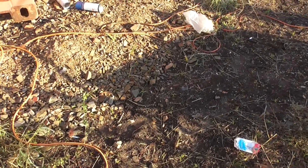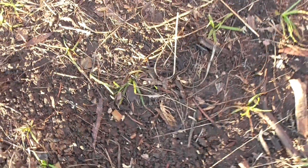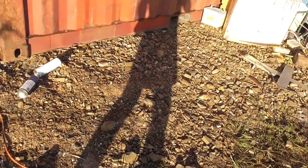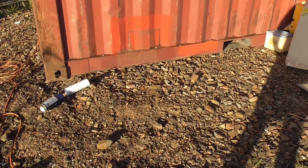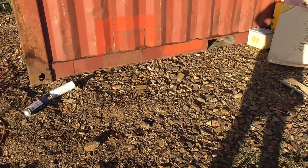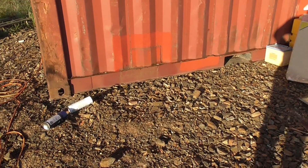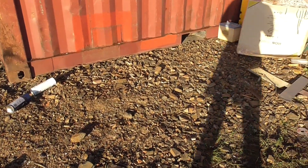We have to do that here because if you look at the ground it's all black mud, so everything will actually sink into the ground. I spread it by hand too because it saves a lot of money. If you get someone in with a bobcat or tractor to come and level it, it costs you hundreds of dollars. Three or four hours spreading it by hand isn't much.